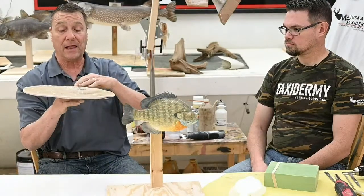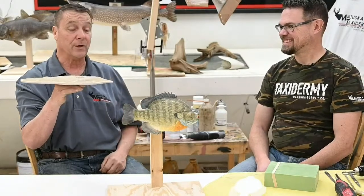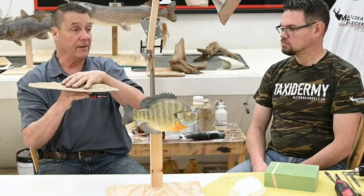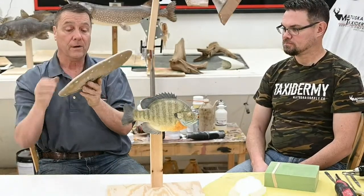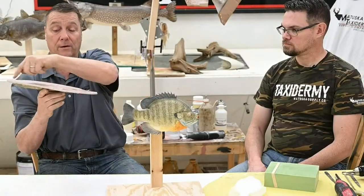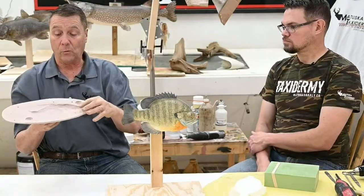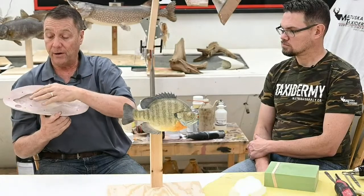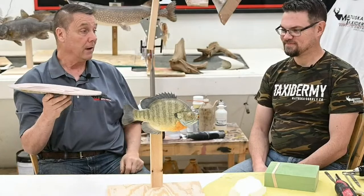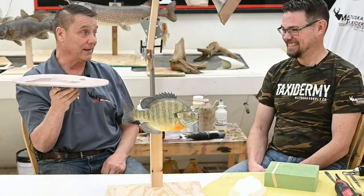When you thin it with polyester resin, it takes a little longer to set up. Then we put a couple layers of fiberglass mat. Bondo isn't all that strong — I compare it to potato chips, but it can break very easy. You don't want to go to all this work and have it break. So we put a couple layers of fiberglass mat. With the heat of the bondo, the fiberglass mat sets up pretty fast. We flipped it over. You're going to have all kinds of little frayed fiberglass and flanges and auto body putty irregular trim around there. Sometimes we'll take it over to the bandsaw and just run it around — that auto body putty will trim really easy.